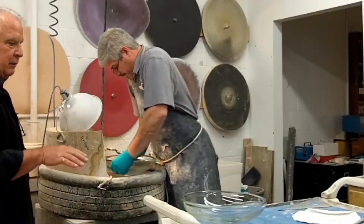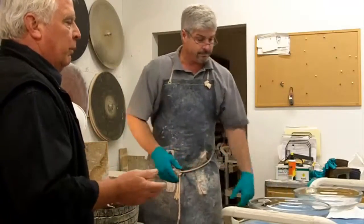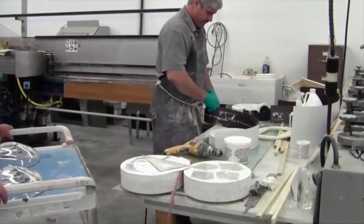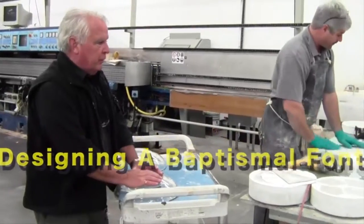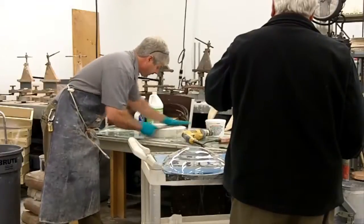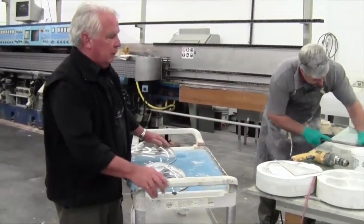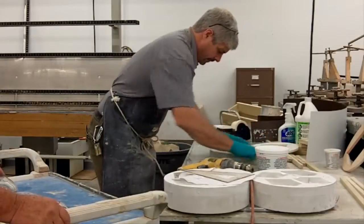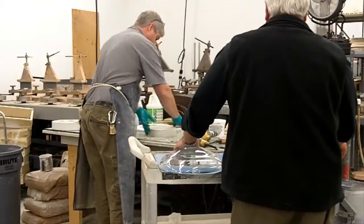So you understand, Charlie? We're just starting the flat — we'll have to do it on machine, so it'll be 100% flat for a lamination. What we're doing now is we took a flexible piece of metal, put it around what are going to be the foot or post for the fonts, and we put them on a perfectly flat surface. Then we can pour plaster around them to hold them in place. We did this yesterday so the plaster would be almost dry — you can see it's still quite wet — but Rob's just making it level.